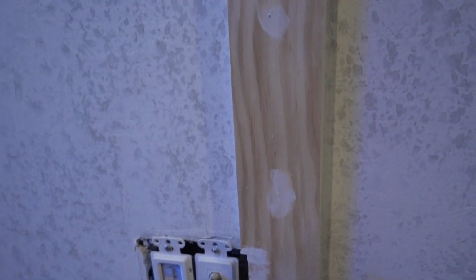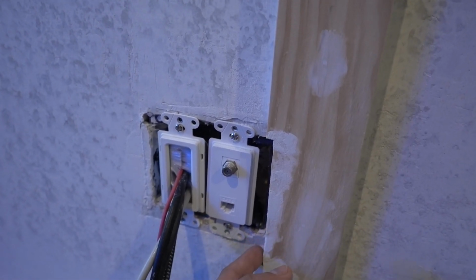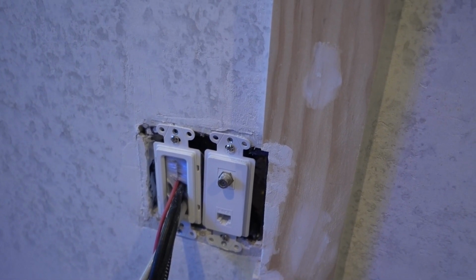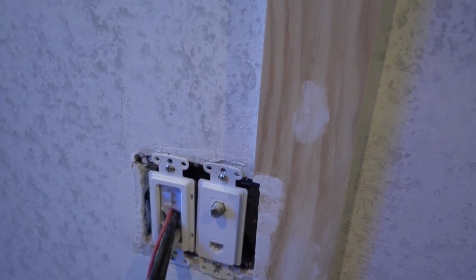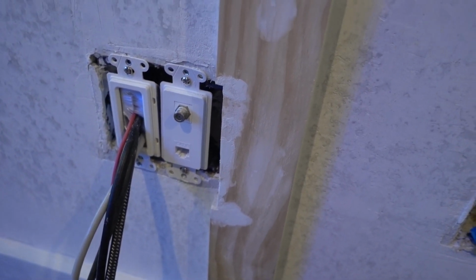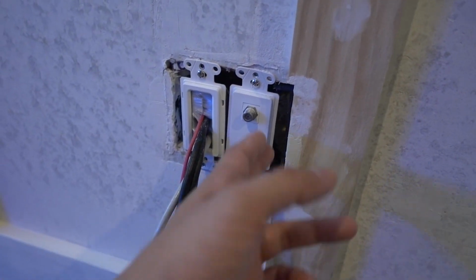The most challenging part of this was, I would say, this right here, because I haven't used one of those multi-tools. That's what I used to cut the C shape. It grabbed and started kind of going off on the side and cut some of this other area. So that's why I had some wood filler here to fill up this wood a little bit, and I'll probably just sand it down a little bit more to make it smooth. But again, you won't see this because this stand here is gonna block all this.